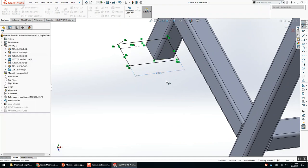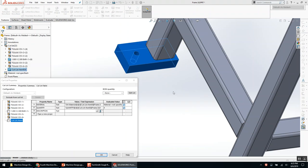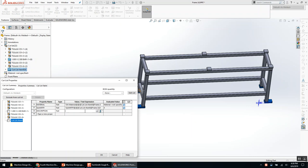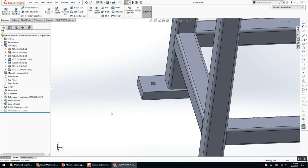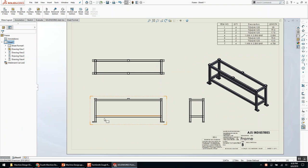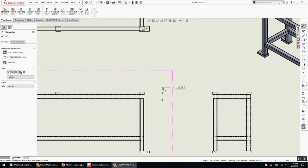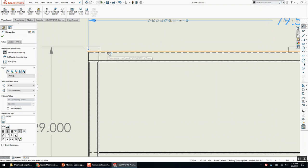Is there a way to get it to fewer decimal places in the cut list? Yes, somehow — I worked with a customer on tech support on that and we fixed it, but I don't remember how. If somebody knows, I'd appreciate the answer. In this instance, because I don't have the length automatically, I'm going to add a read-only driven dimension — two of them to show how that works. Going to properties, typing in the description: start with the small dimension first — one, dash, two and a half bar, four and three quarters. Going back to the drawing, that fills in as it should.